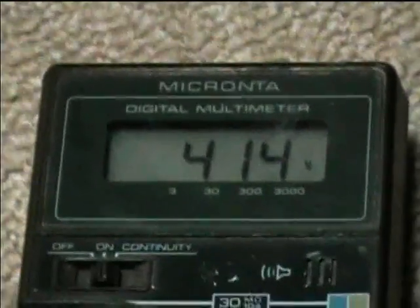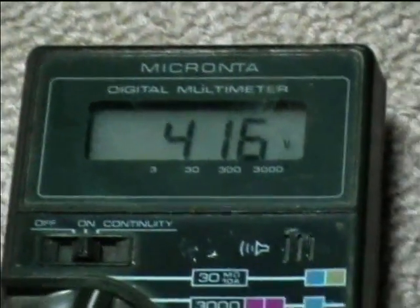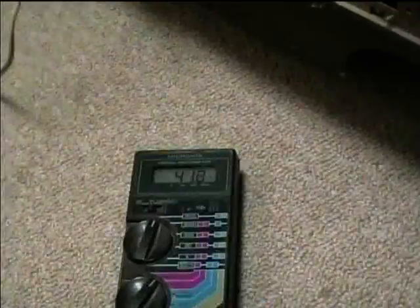I'm going to try measuring DC voltage through the flyback transformer with the horizontal output plate lead disconnected. You can measure the DC voltage through there, of course not with the tube connected - there's about 6000 volts AC there with the tube connected. But with the plate cap off, you'll just read the B+ voltage through the flyback if you've got continuity through it. We do have DC voltage at the flyback - 416 volts, very high DC voltage. But that's about the normal voltage supplied by the B+ supply. You have to be very careful when working with these circuits powered up. I always like to make the connections with alligator clip leads so I don't ever have to go probing in live circuits.